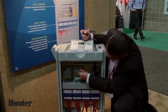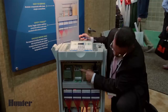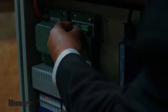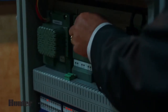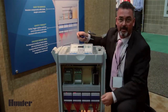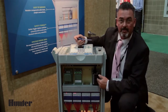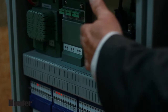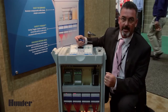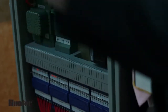In the hardwire version, we have the ability at each controller to have the incoming signal come in on one channel, and then we can split that signal in two different directions at every location. If you require a maintenance radio to operate your sprinklers on the golf course, you would simply add a UHF radio module to any controller on the system. This then has the ability to operate all satellites that you have on your project — just one radio, all satellites.